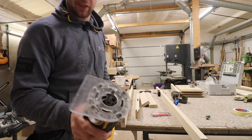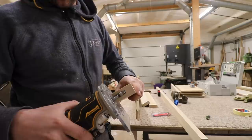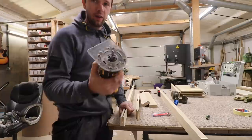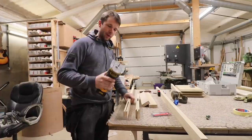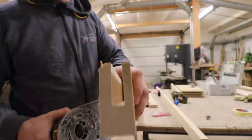What I discovered once I got the bit was that the nine-and-a-half millimetre diameter fits perfectly in my cabinet door nine-and-a-half millimetre mortise. So what I've been looking for for quite some time is a router bit that would do a cut in the bottom of these mortises to give me a perfect depth setting for a stub tenon or haunch. Setting this so the tip of the shank is in the router, I can get a 45mm depth of cut — which is about perfect for a normal door haunch depth. So from the inside edge of your stile, 45mm is perfect, and with the double bearings, this cutter should do everything I need.